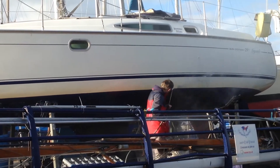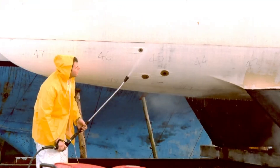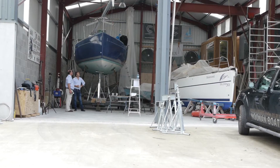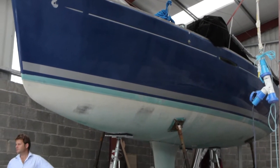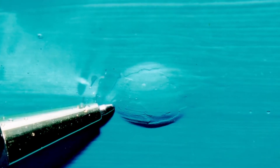So we must try to eliminate extraneous moisture before we take any readings. The first job then is to pressure wash the hull with fresh water to remove weed, slime and salt, as these will all retain moisture. A clean hull will also be much easier to examine. If you are looking for blisters, this is the best time to see them whilst the hull is still wet and before any blisters have had time to shrink.